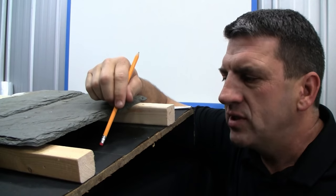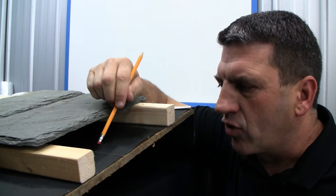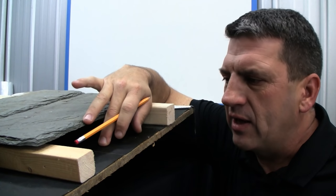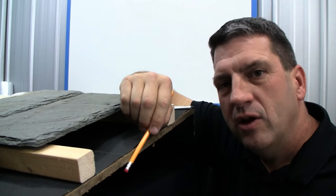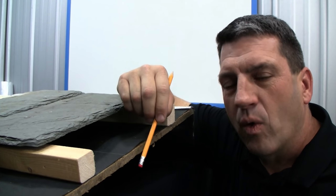Here's an example of a roof without a radiant barrier. What happens is the roof gets hot, it radiates heat across this airspace, the roofing felt absorbs all the radiant heat, and then that heat is transferred into the roof deck, and then it's going to continue on into the attic or the building.